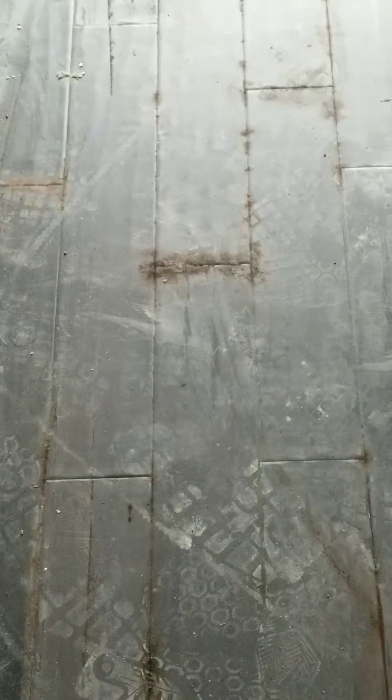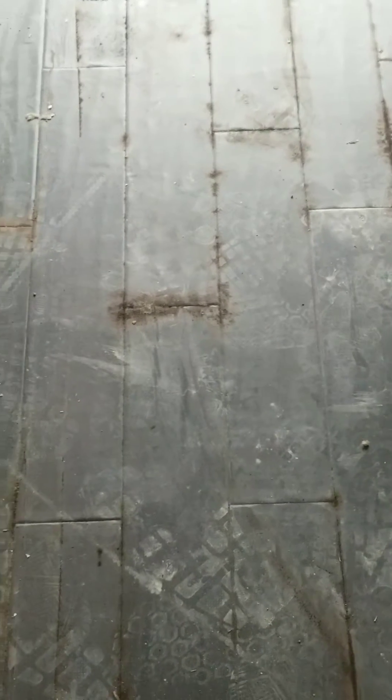Take a moisture sensor and see if there's less than 10% moisture coming up through that slab. I'm not sure how successful that would be in every case, but at least it gives you something to try. Ten percent is the threshold we strive for in moisture content in walls and anything inside a house. Test it before you embark on a new floor. If you have high moisture content, don't glue it down — put down a plastic membrane and do a floating floor. That could save you a lot of headache and expense down the road.